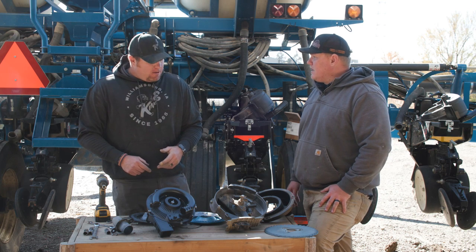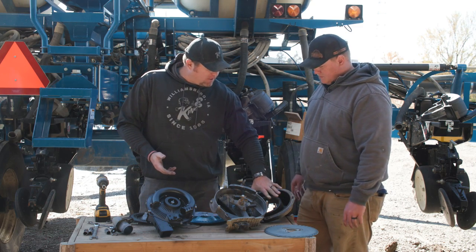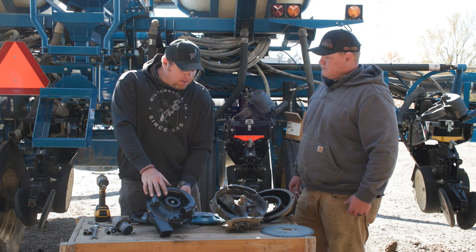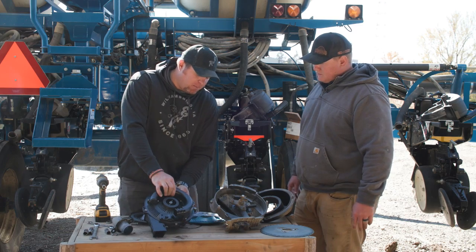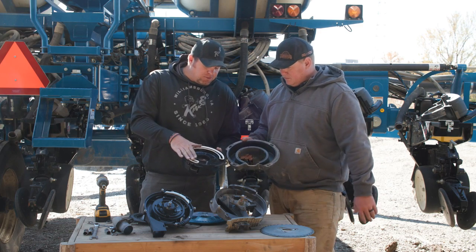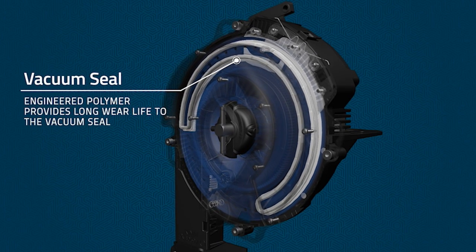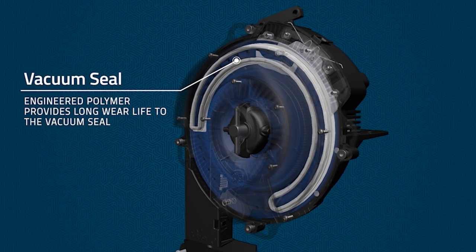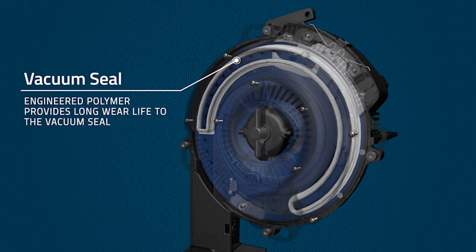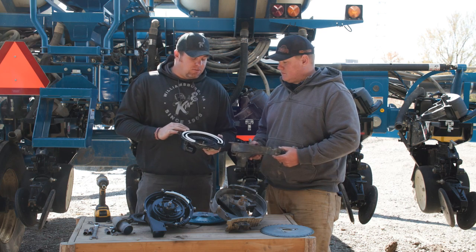What's the advantage of these newer meters? A couple of things — wear components first. This housing is your vacuum seal. On the true rate meter we have a much easier mechanism to take the meter off: just a lock tab at the top, quarter turn, and it comes off. The big difference from edge vac to true rate is there's actually a neoprene seal on here, so the disc isn't fully pulling against the housing. The housing itself never wears out — you're always riding on the seal — providing a much better sealing surface, allowing you to run lower vacuum, lower horsepower requirements, and lower hydraulic requirements.